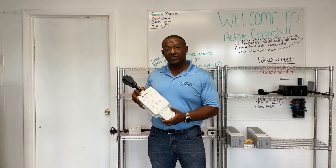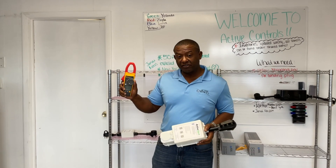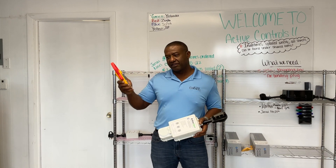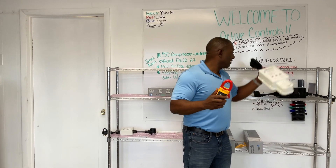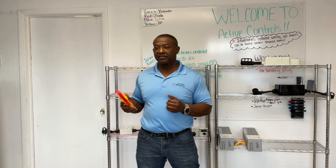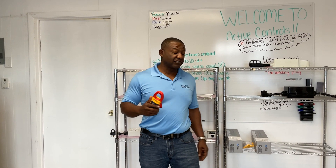I also wanted to mention my new fancy meter here, which has a setting that you might have seen in my other videos called Inrush. I want to explain that a little bit more. Most meters — and even myself in early testing — we looked at peak current. Peak current is just what it sounds like: the very first spike, the max. And you'll see on my soft starts, I get an 80% reduction on peak current.